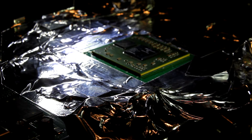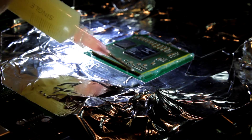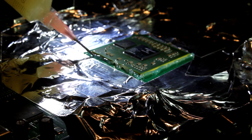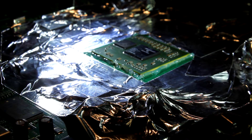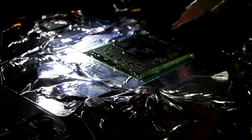Because we're lifting the chip, we're going to use a lot of flux. During a reflow you wouldn't use this much, but we are lifting it and we want to lift it nice and clean. The more flux the better, in my opinion. Just apply it along the edge, and once it heats up, it just gets sucked in right under the chip.